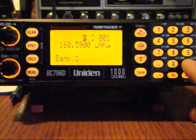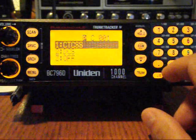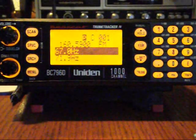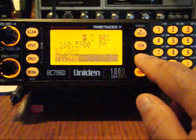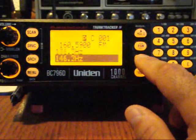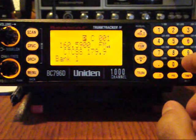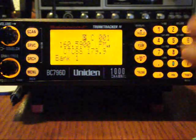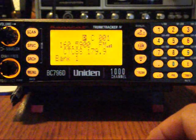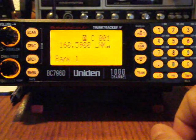What I've done in the past is go into the entry for this frequency and turn it on to DCS or CTCSS, and it would cycle through values — 67.0 Hz and so on — just going up to different numbers. If I put in any one of those numbers it will accept it. However, if I set that CTCSS or DCS on both frequencies and scan, it's not picking up anything — just scanning something totally different. So I have to go back and turn it off.